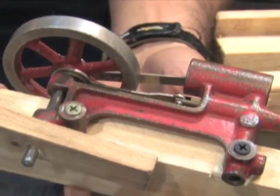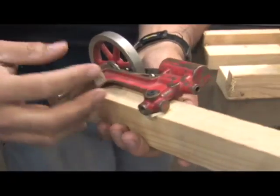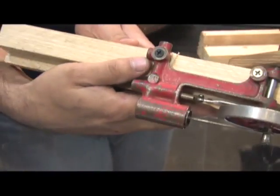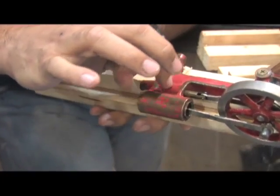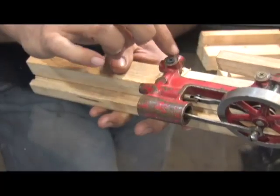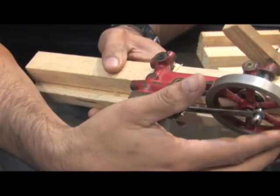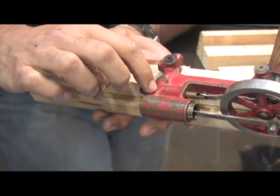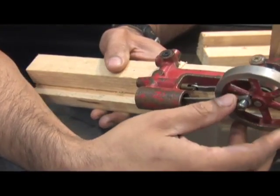This is another steam engine that I have — one that I purchased off of eBay, it was in pieces and I put it back together. In this particular engine, steam enters through the side here through a little pipe. There's a pipe inside that slides back and forth with three holes in it. When it's in the steam-entering position, the steam comes in and travels right into the cylinder, then it opens, closes, and goes to the exhaust position — exhausting out through the front, which enables the piston to come back and close.